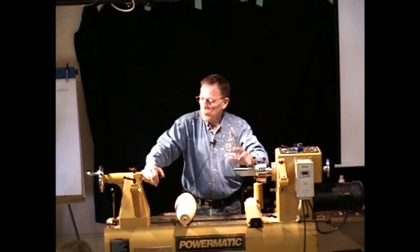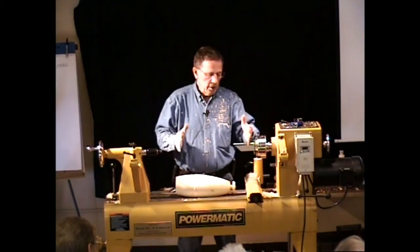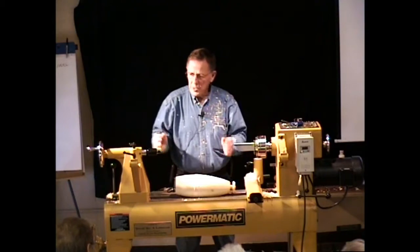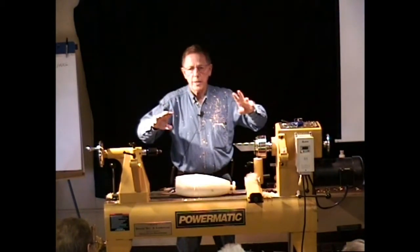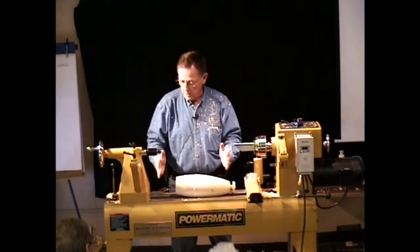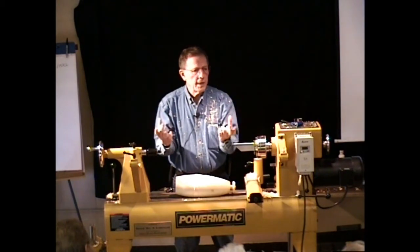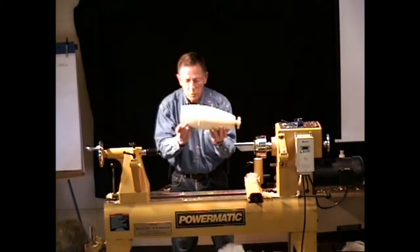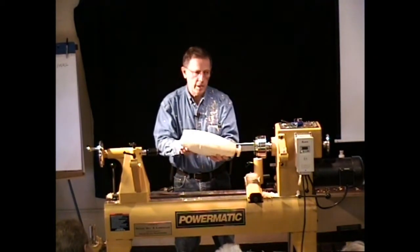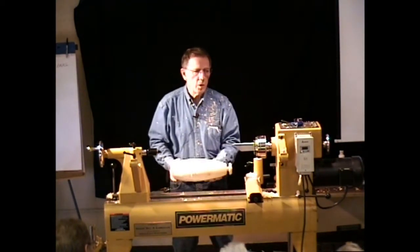There, and that brings me to another little suggestion. If you want to put a heavy piece on a lathe, and get it very accurately mounted between centers and in a certain place, get yourself a couple of car jacks, these are scissors jacks from small cars. The smaller the car, the better. The smaller the jack, the better. And have somebody weld or bolt a couple of little saddles on them so that they will hold a piece like this. Then you set that piece on those jacks and you can precisely get it located where you want it, down to the fraction of an inch.